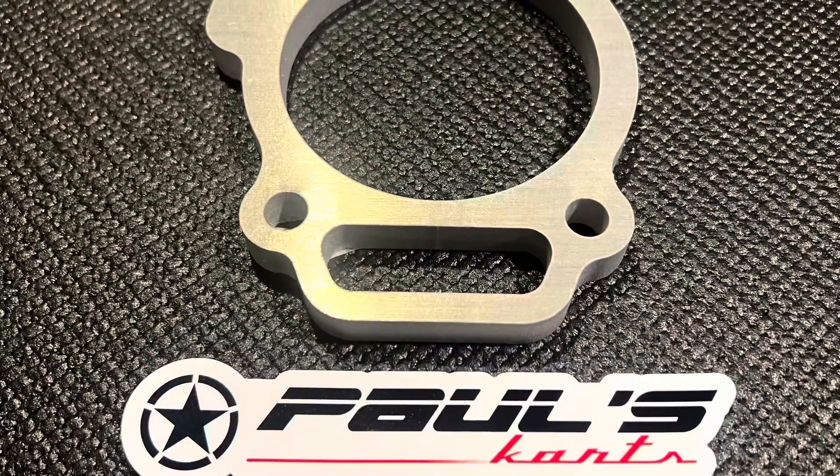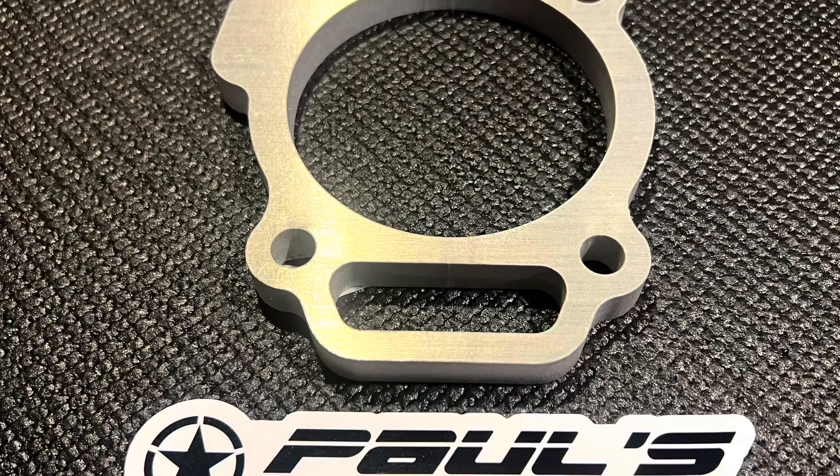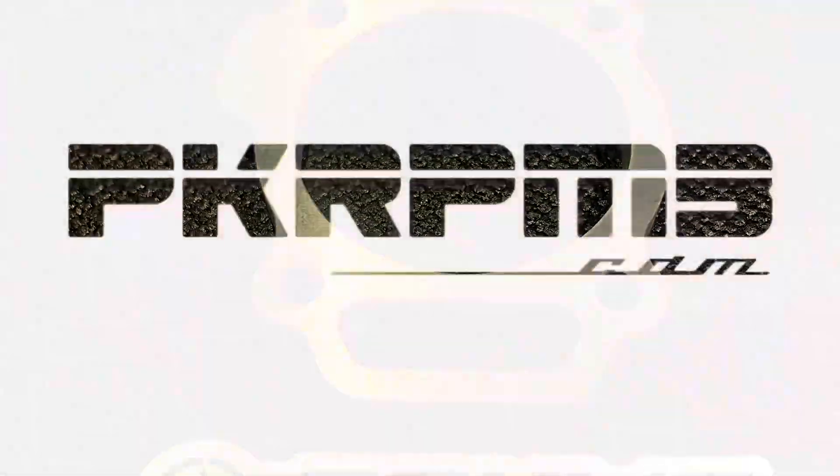This one's been fully worked over with the epoxy. We have a couple of stages to the epoxy work — this one is a full custom epoxy port; we've done full flow work on it. This is an amazing cylinder head, and that's why I'm taking the chance to film it. I'm actually going to take pictures of this exact setup with the copper seats and this spring package — this is exactly how I would recommend it to be run. I'm going to put this package up on the site.